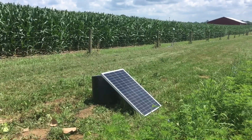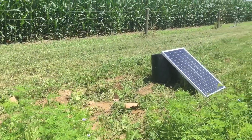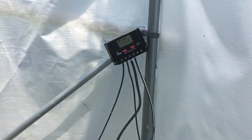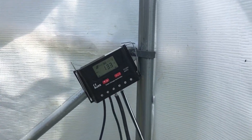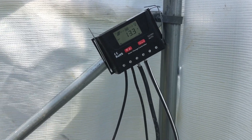So let there be solar — I just temporarily have this set up right now. There's a 100-watt solar panel there, wires come in to the charge controller, and right now with full sun I'm getting 13.3 volts.